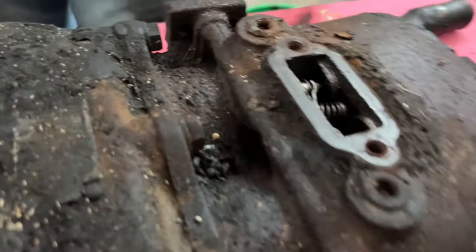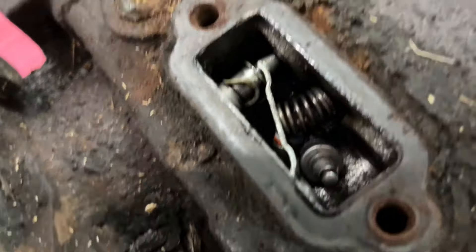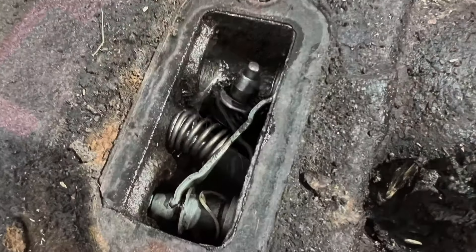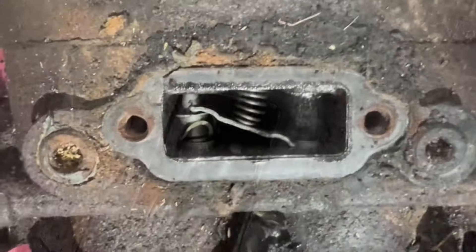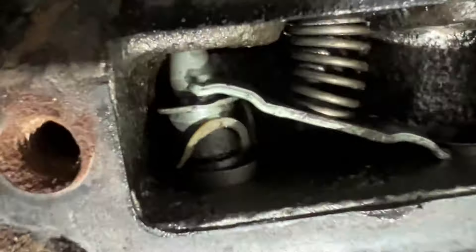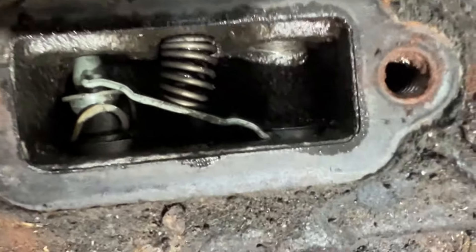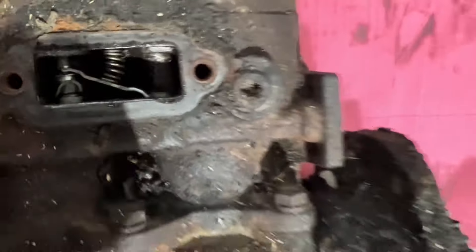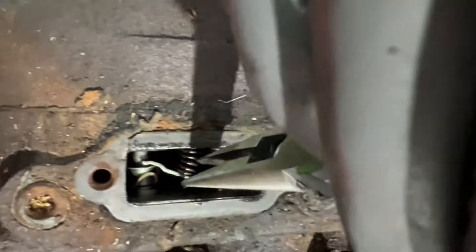There's the problem. The unloaders — that's what tells it to purge and to stop making air — are definitely bad inside there. That O-ring is coming out of there, and this is a balance between the two. This one was flopped out of its positioning. You're going to pull this plate out and that spring is going to kind of come flying.